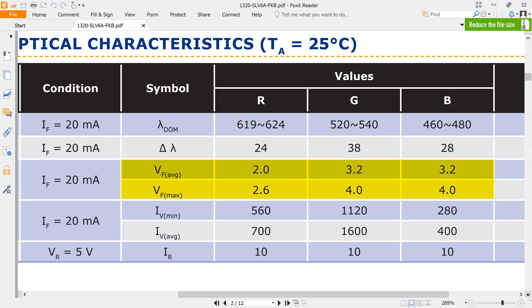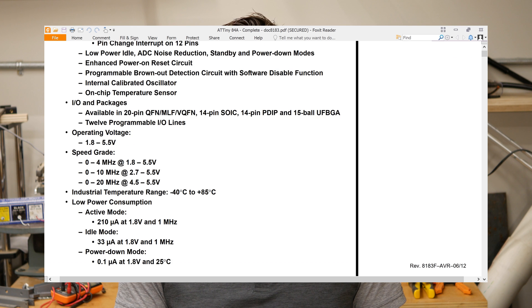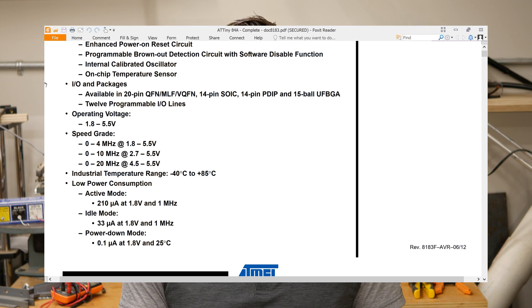There's nothing in this circuit that actually needs 5V. The green and blue LEDs only need about 3.3V to operate, the red LEDs only about 2.1V, and the ATtiny can go down to 1.8V. 5V is overkill, and if we're working harder to step up back to 5V, all of that power is just being wasted as heat. Just terrible.